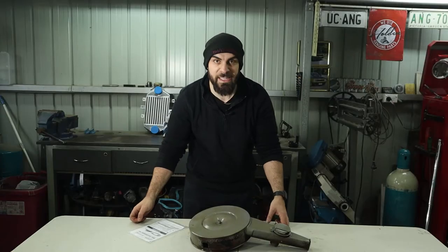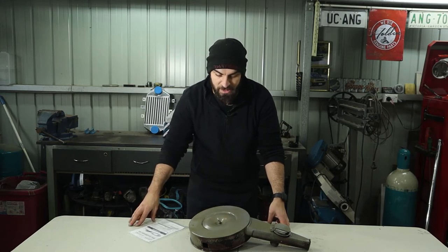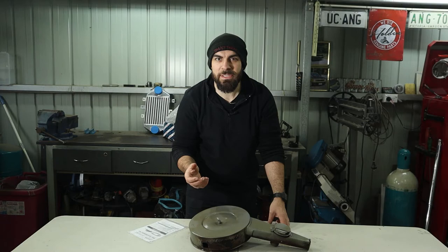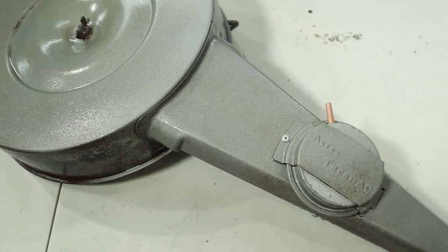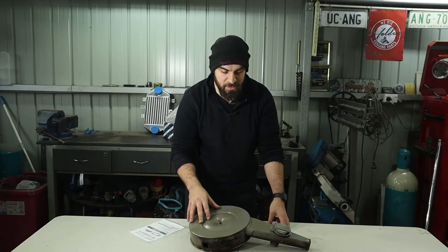That works pretty killer. That surpassed my expectations. And that's with a 15 degree MEG nozzle in the gun. They say to use a 0 degree, but the amount of spray and how easily and quickly it took off that flaky paint and the surface rust, we saw it literally in seconds.